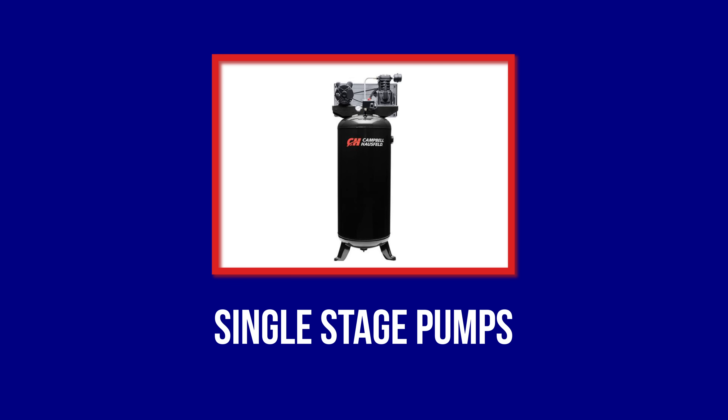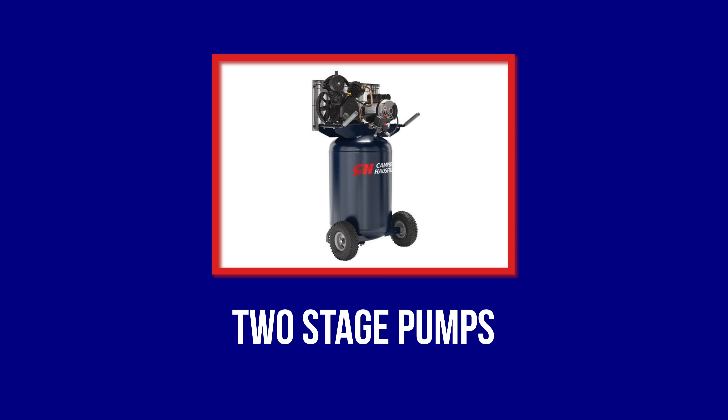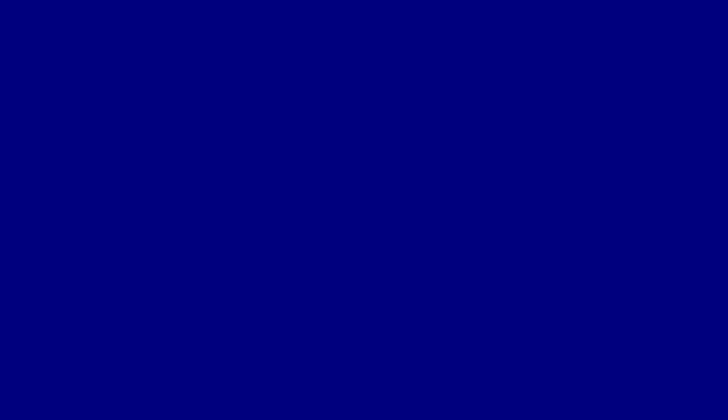There are two different types of belt drive pumps commonly available. Single-stage pumps deliver compressed air directly to the tank. A two-stage pump creates pressurized air in a larger displacement, low-pressure cylinder, pumps it into a smaller high-pressure cylinder, and then fills the tank. The main reason for buying a compressor with a two-stage pump is to create an adequate supply of high-pressure air required for tools like a spray gun or air drill. Many two-stage pumps are intercooled between stages to reduce heat buildup, since compressing air creates heat and less heat equals more efficiency. Don't confuse cylinders for stages — it's possible to purchase an air compressor with two cylinders that's still a single-stage pump.